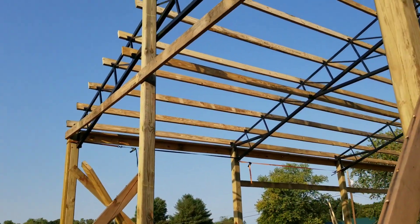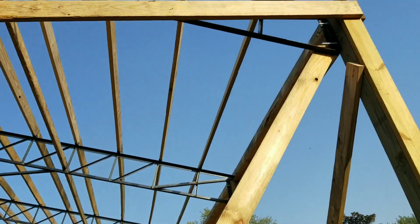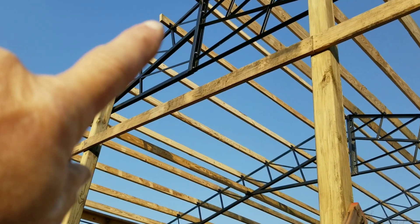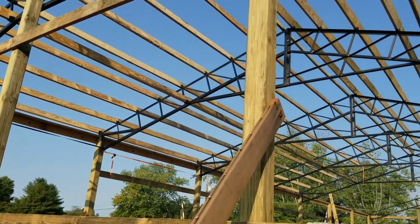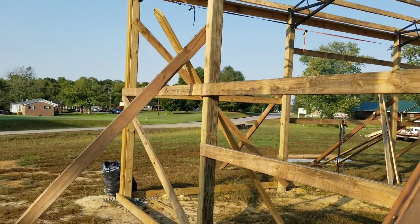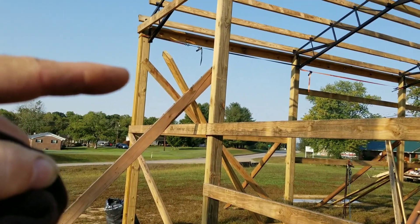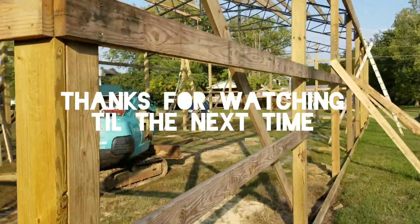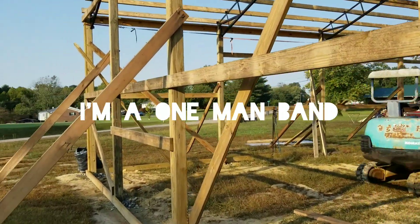On the ends, as you can see, they're six inches sticking out of the truss and they meet up with the six-by-sixes. They'll get a board that comes from the top all the way down — I haven't gotten that far on the capping, or banding as a lot of guys call it. I've got two more rows of band to do — one here and one there all the way around the whole building. Today I'm hoping to have the other two trusses and the other purlins in.